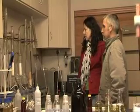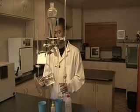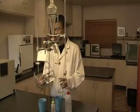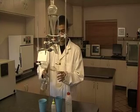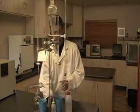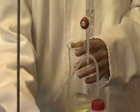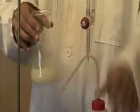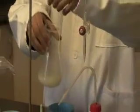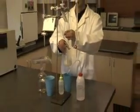The laboratory is running 24 hours, 7 days a week, same as the plant. The purpose of the lab is firstly to test all seed that we receive during the year for oil content, protein, and moisture. Secondly, it is there to test crude oil for FFA, peroxide, color, and soap content. Thirdly, we test the final bleached oil for color and FFA.